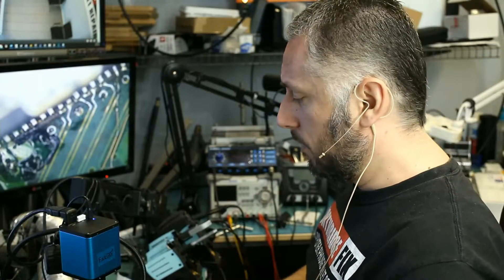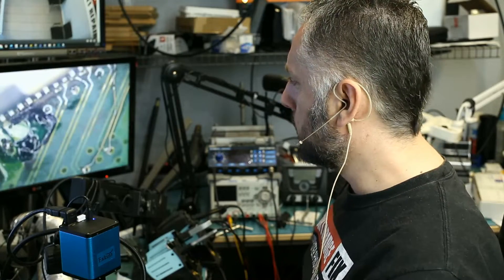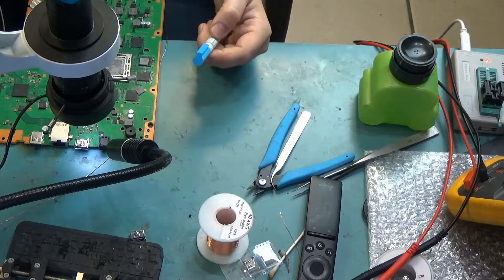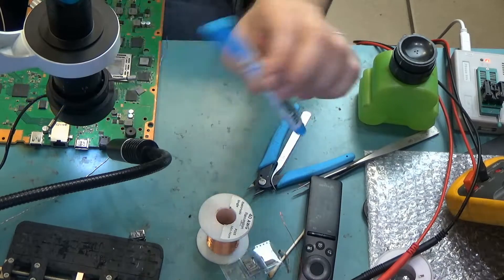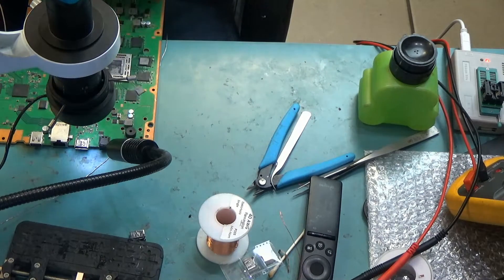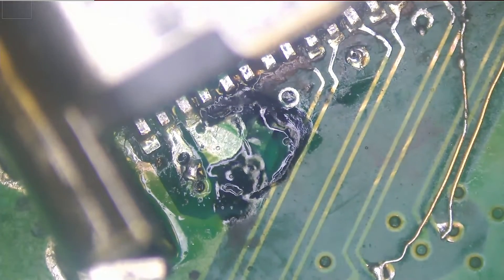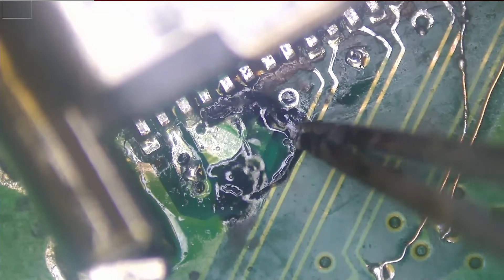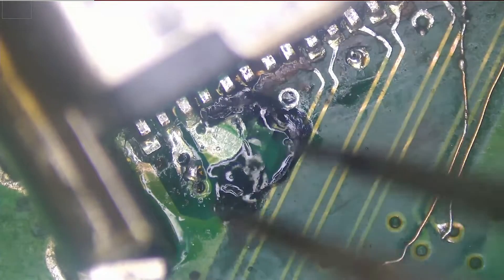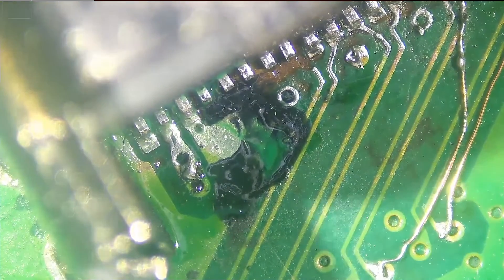I had to leave this overnight because time was running out. I applied an overcoat over the exposed area of pin number three. Initially I used the UV mask, but I feel like the overcoat pen is a lot better — it makes a more solid layer on top of the exposed pad. For the UV mask, you can see the leftovers look something like this. Whereas with the overcoat pen, you can barely see it's there, but it's covering the pad.